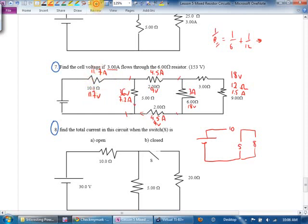So, you know what? This was all a big waste of time because I didn't read the stupid question. My fault. Start at the battery. How high is this battery? I don't know. Let's walk through a ski run. There's one ski run that gets me to the bottom of the battery. How many volts do I lose going through here? 117. How many volts do I lose going through here? 36. How high must the chairlift be if I'm losing 117 and 36? It's got to be 153 volts. Does that make sense? After I thoroughly botched that explanation, but hopefully I recovered at the end there.